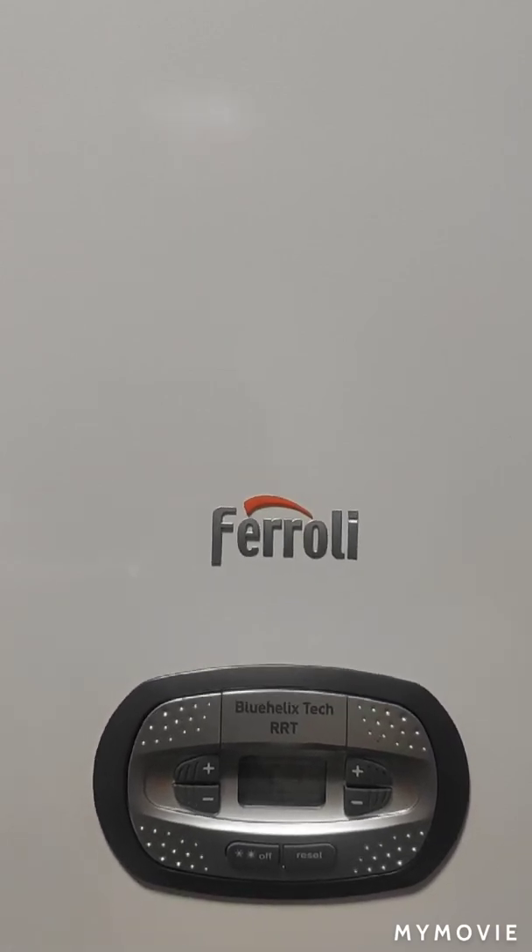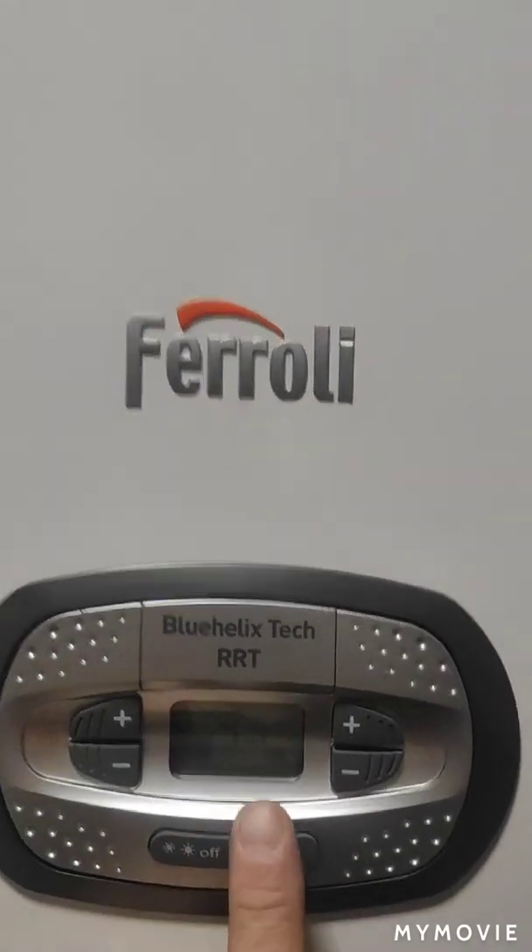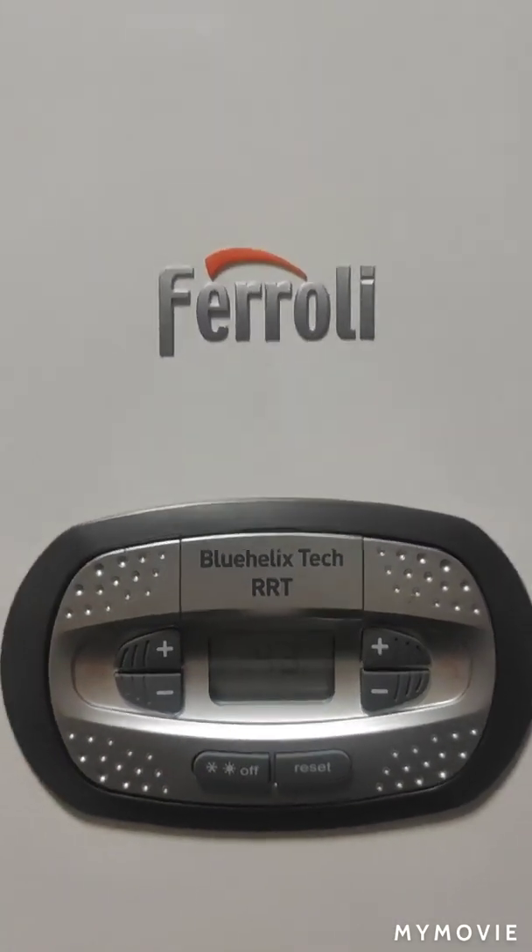This takes about a minute to do. Sometimes you will hear squeaking — that is just the gas valve adjusting itself, because you are setting it up from scratch. Eventually after about a minute it will just go to the normal screen again, and then you can actually use it. There's the squeaking — that's normal when you're setting up the boiler. Once it stops, it will go back to the normal screen, and that's it. You're done. You're ready to go. You can start using the hot water and the heating.